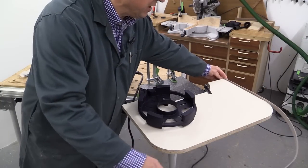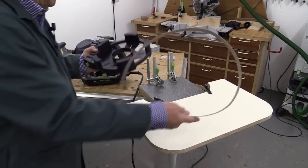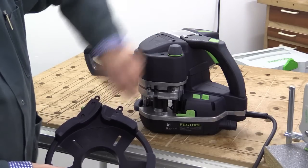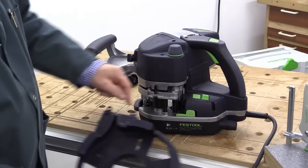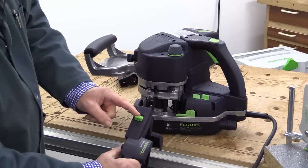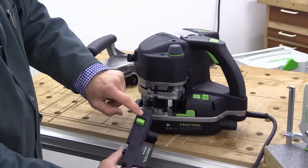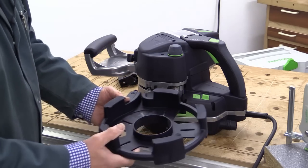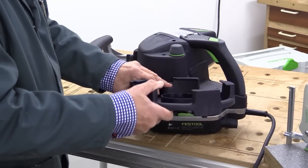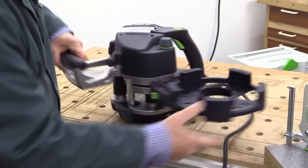Here's the piece of edging I'm going to put all the way around here, and I do want to demonstrate the magazine holder. In order to fit it, you'll note on this side of the machine there's the width adjustment knob, the Festool sign, and a pair of lugs — one there and one there. On the magazine there are a pair of corresponding holes and a locking knob. Make sure for fitting that the knob is in the open position — there's a padlock sign showing open and one showing closed. The easiest way is to locate the left-hand pin first, then give it a little wiggle and encourage it down, and then lock it with the knob — that's it firmly in place.